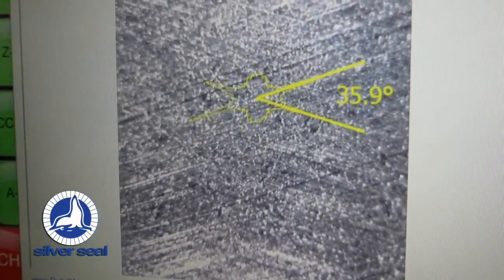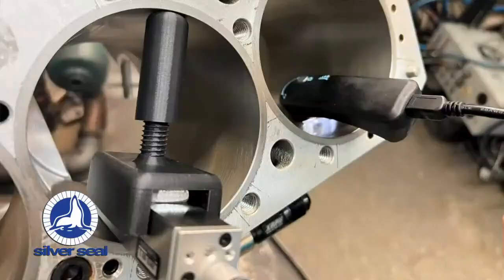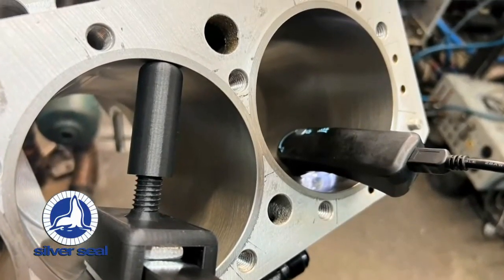So this is your seeing eye, actually. This is our seeing eye. You go in there and it sees it, and the software figures it out. It looks at that crosshatch angle, indicates it, and shows you right there on the screen what the crosshatch angle is. Isn't that cool? It's another tool for verifying what you have, no different than the profilometer is for measuring surface finish. This is your optical tool for measuring your crosshatch angle. As you and I have talked, we keep getting better and better at this, because we have the tools to measure and quantify.